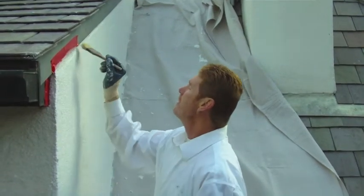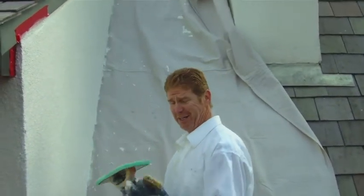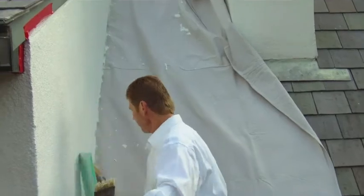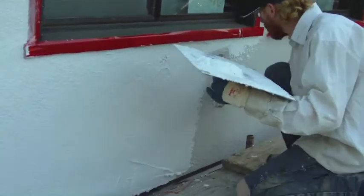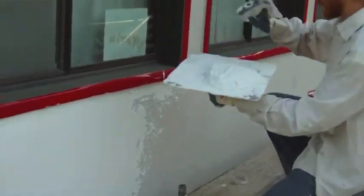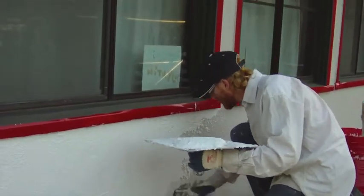Jay just spread this side out now. He's holding the camera and I'm filling it in. It was tough enough with the ladder they had originally — the pitch is much too steep to do it just by leaning. But now that we set the staging properly, this plastering is a two-man job. Jay's usually doing the camera but I've got it now while he spreads. That way he spreads, I float — it's a two-man job. We're actually on our second bucket of Parex on this.